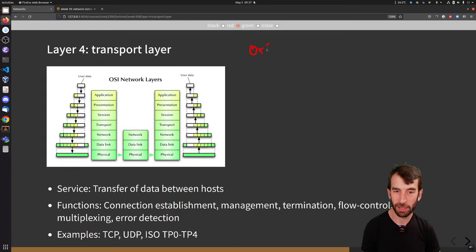So if we look at MIDI, we had 0x90, that was note on. And that was one frame. But that's not going to be a whole MIDI message. As I told you last week, we need to have 3 bytes together. 7F, not FF. You idiot, Charles. Okay, that's one MIDI packet.